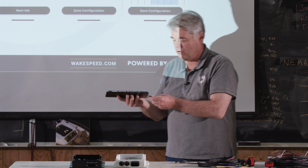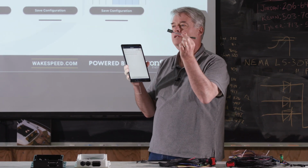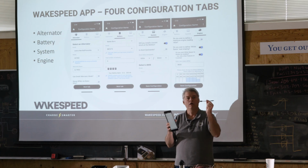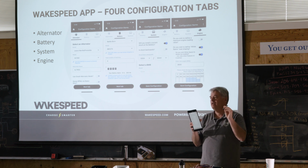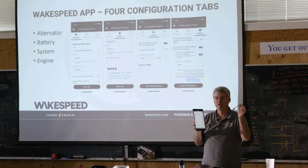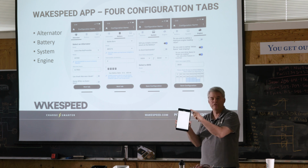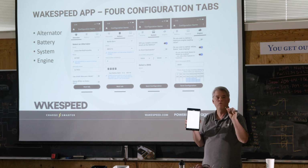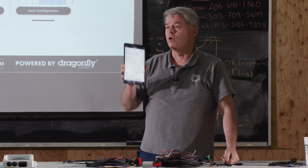I'm going to take my on-the-go cable, OTG. When you go to Amazon, you're going to search for OTG adapter. OTG USB has this big specification. One of the chapters in it is OTG. This is a special cable. It changes the behavior of the device you plug it into. You can't just get something that changes this connector or this connector. It must have the letters OTG, all in caps. They're like $4 on Amazon.